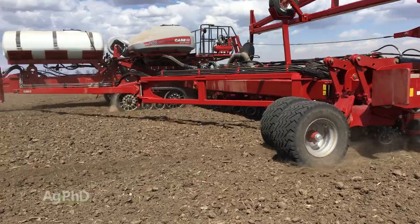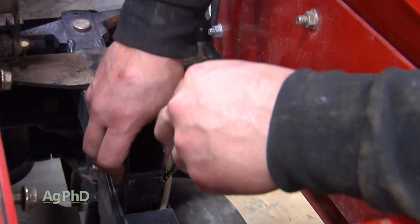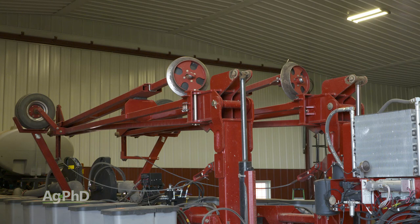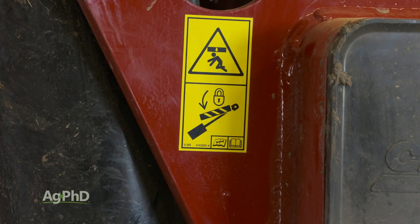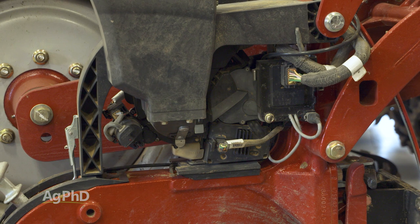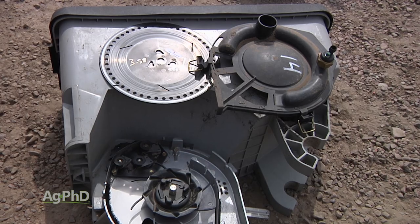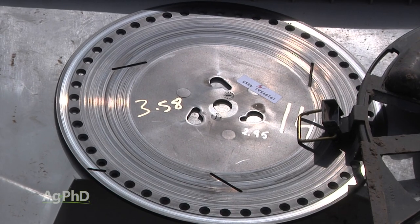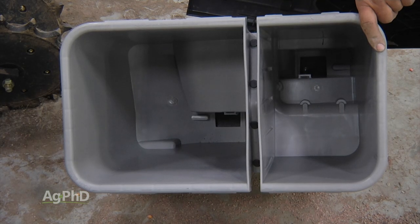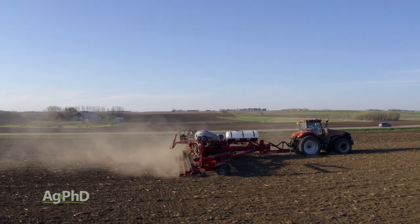Some overall machine things include properly inflating the tires, disconnecting the hydraulic and electrical lines, and covering the connectors to keep them clean and protected. Fold up the planter markers and install storage locks on carrying wheel hydraulic cylinders and drawbar hitch cylinders. Seed handling issues include removing and cleaning the seed meters — check them thoroughly and look for wear and parts that need replacement. With seed discs, storage can be done by hanging them through the center hole or placing them on a flat surface. Empty and clean out seed boxes and hoppers completely, as we see issues every season with junk, clumps of dusty seed treatment, and old seed plugging things up.